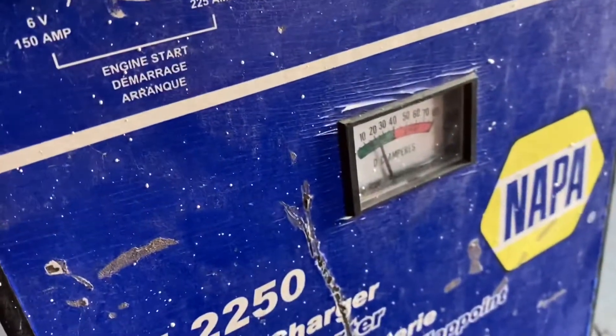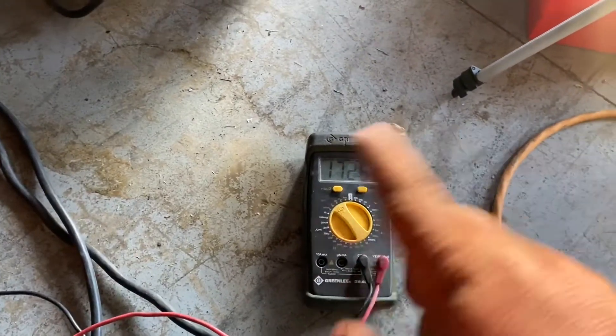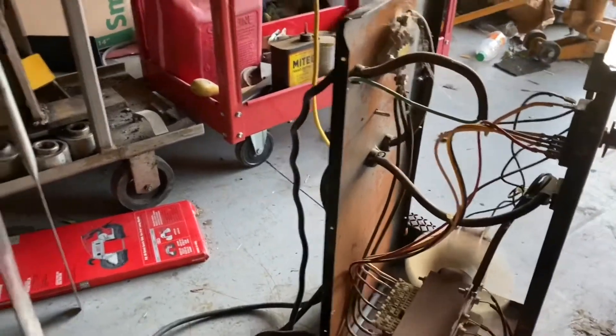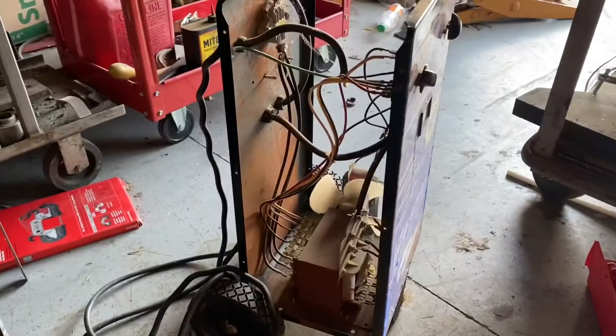This gauge wasn't working before and now it's working. The volts were bouncing wildly before, no matter where it was, but now it holds nice and steady. So I think I randomly fixed it. First thought it might be this component but there's no resistance through it. There's a bridge rectifier in there because it has to convert AC to DC. There's no weird resistances — basically I just pulled it apart, cleaned it, and problem solved, I guess.